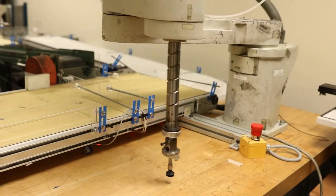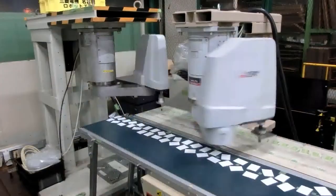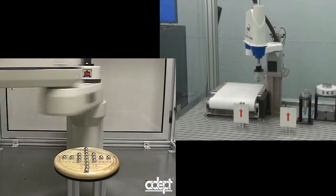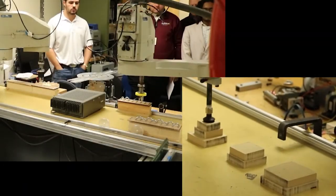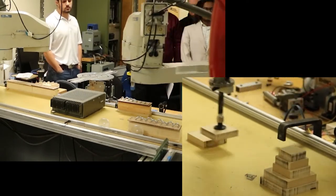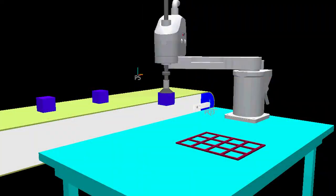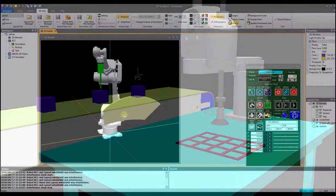These are our Mitsubishi RH-18SH robots. They are four-axis robots that tend to be faster than the six-axis LR Mates, but not as fast as the Delta robots. These particular units have a max payload of 18 kilograms. Also used for assembly, our four robots were donated by IPS in Collierville thanks to Joe Williams, one of our alumni who also took the robotics class. These robots are often used when parts need to be picked straight up and placed straight down in a different location, as can be seen in these sample videos.